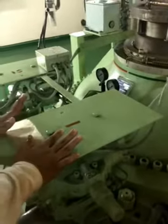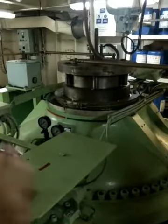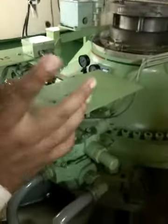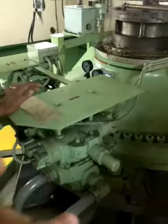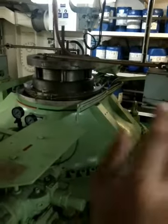For emergency steering, the common process is: first you should switch off autopilot. Before switching off, you have to inform the bridge. Obviously inform the bridge, switch off autopilot, then you should know which pump is on the emergency generator — when the emergency generator starts.